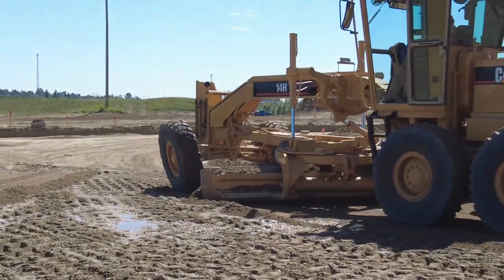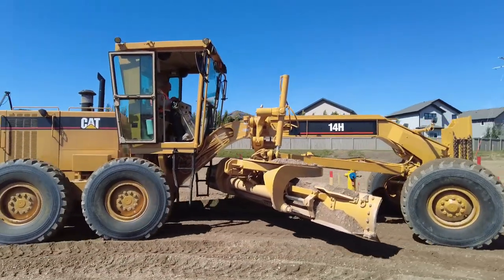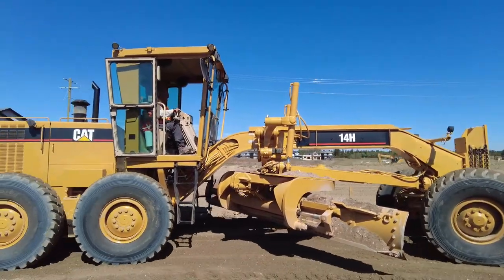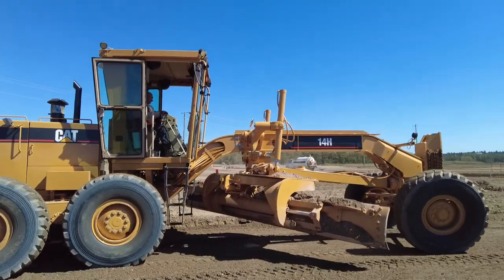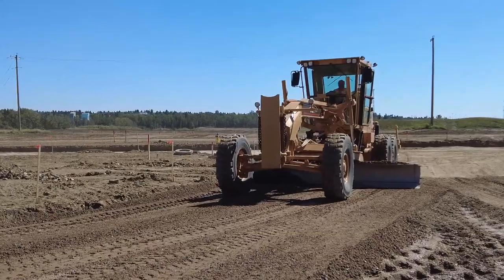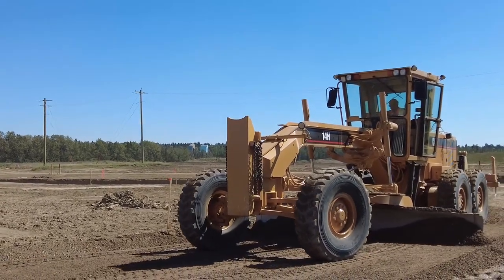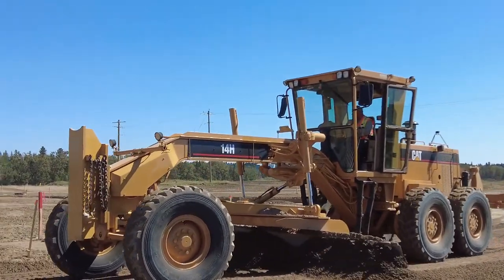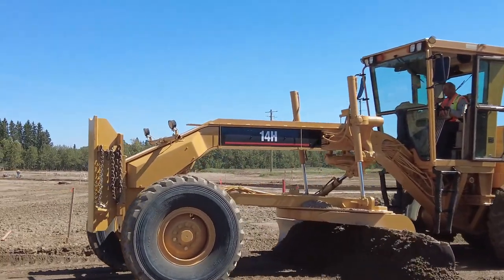But these bubbles are not all like that. Sometimes they're actually flat. If there's a big high point in the back end, sometimes they will be flat across. But more usually, they do have a crown in them, and this one does have about a 300 crown in it. Now, we call these bubbles, but what they are is just a circular turnaround. They are designed in different sizes. This is actually quite a small one — probably only 25 meters in diameter. I think it looks like there's about 10 or 12 residential lots around the perimeter of it.